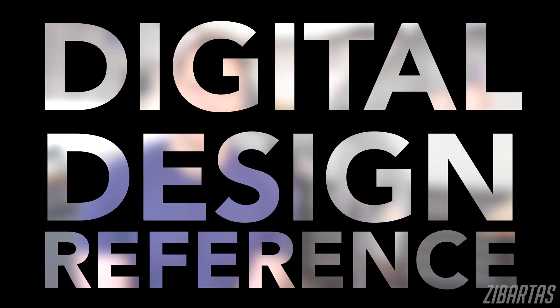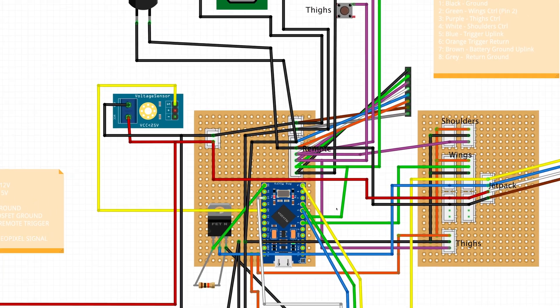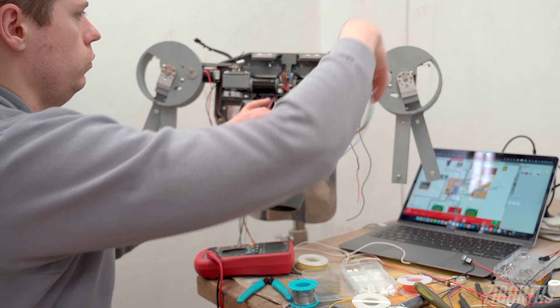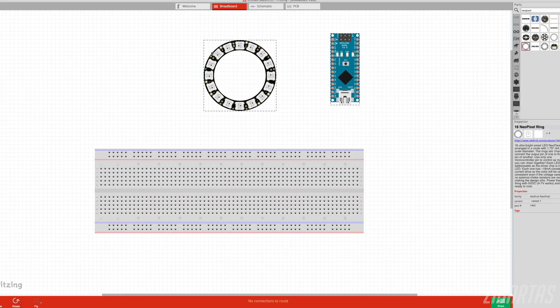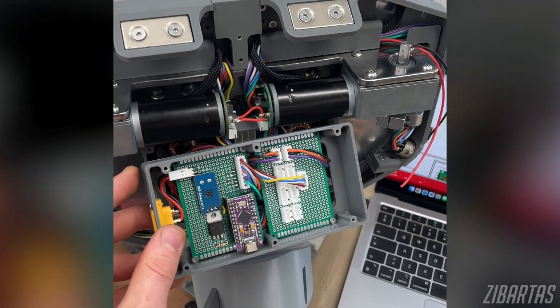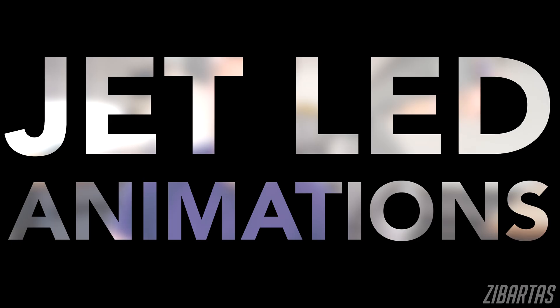All the harnesses are color-coded and also documented in Fritzing. Speaking of color coding, this is more of a feature of my workflow rather than the design itself, but it's really important if you don't want to pull your hair out while troubleshooting. I made a standalone video for Fritzing a while back already, but essentially it's just so nice to have a visual reference for all the electronics in front of you, so when eventually something goes wrong, you have a better idea of what could be the cause. If I were to produce these as a product for sale, I would probably get the circuit boards printed professionally, but since all the traces here are done by hand, that's even more reason to document everything.